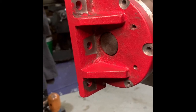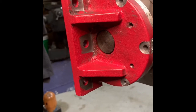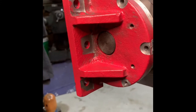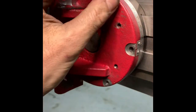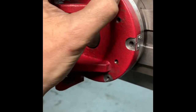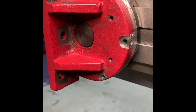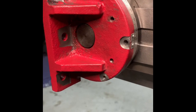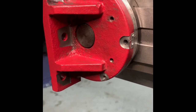This is a casting with a taper to it. I took an end mill and made flat surfaces there, so that way when those bolts and washers go in and I tighten that down they'll be flush. I also did a light facing on the surface where these screws go, so that you have parallel contact of the head of the screw with the washer.